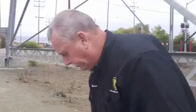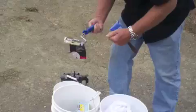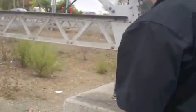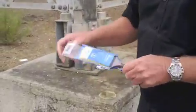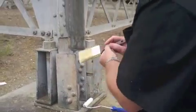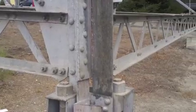Now what we're going to do is very simple. The best way to do this tower is with a low nap roller — a quarter inch nap on a four inch wide roller. The reason this is so good is because it's the exact size of the typical tower, so all you would do is roll like this. You don't have these great big surfaces. The second item you need is a two inch paint brush, because you get around these rivets and bolts. That's exactly how we did other bridges and so forth. These two items — that's all you need.